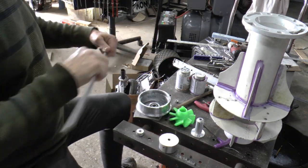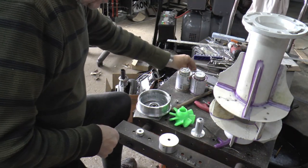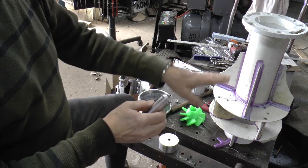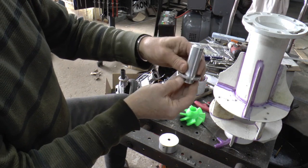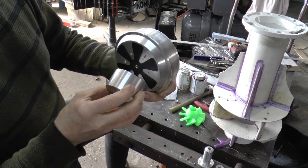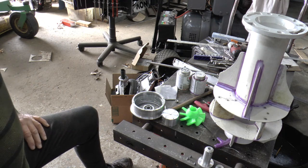In the shaft I put a divot for the one that's in the middle, just to ensure that it doesn't drop down. And I've got places for two set screws in the part for the impeller — I'm going to put a divot once I pick a spot. And I made another collar for the bottom, just to ensure — because I don't want to have to try to fish that thing out of my pipe. This is ready to do the final assembly. I'm going to lock-tight these screws in place, so I'll do some assembly and then I'll have you guys back.